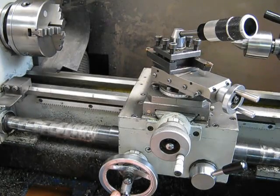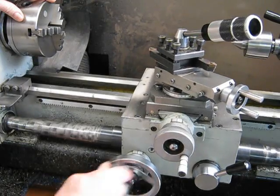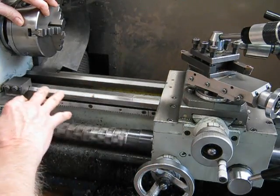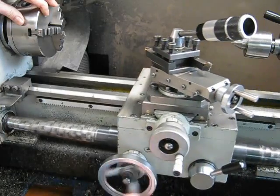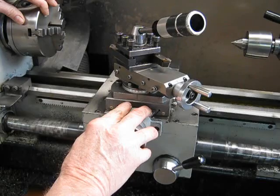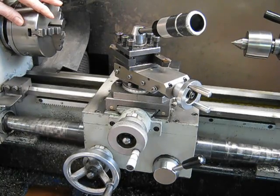People that use way oil will probably flame me, but I don't care — you can use what you like. This has proven to be effective. There are a number of schools of thought on how you should best lubricate a lathe, but for a small, light lathe like this, I think this is the best system. As the oil moves off the ways, it takes all the crap with it. After 10 years of use, when I pulled the carriage off it was as clean as a whistle. If you look at the other video I've done, you'll see exactly what I mean. There are my thoughts on the matter — you can use what you like, but that's how I do it. See you next time.